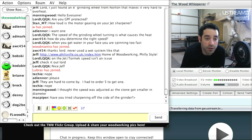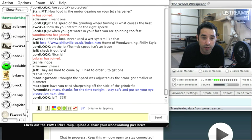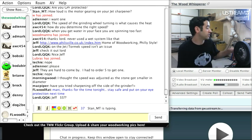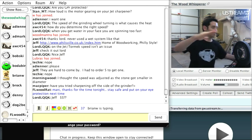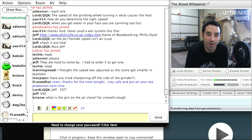You do want to adjust the speed as the stone gets smaller — obviously that changes the amount of contact with the metal. This unit has a dial where you can measure if the stone has ground down enough that you need to do something about it, and you can change the speed to compensate.